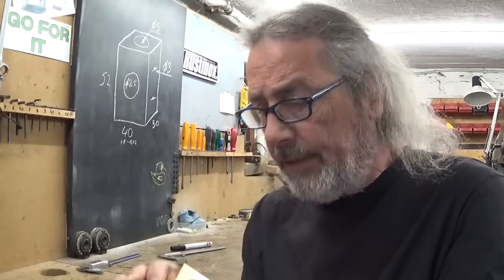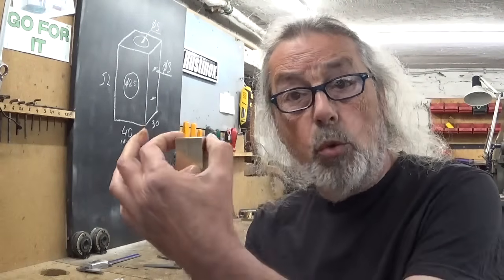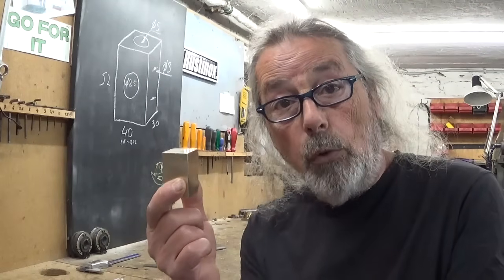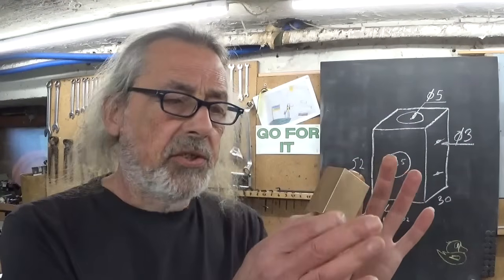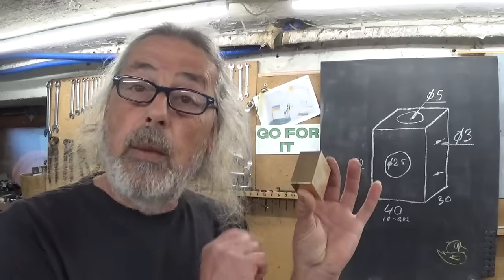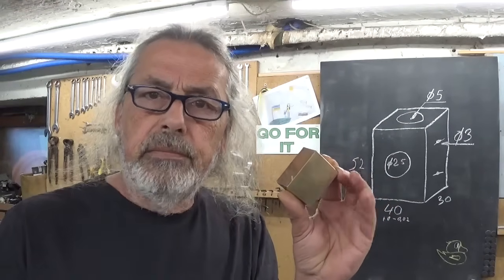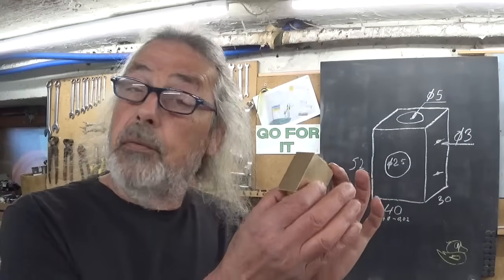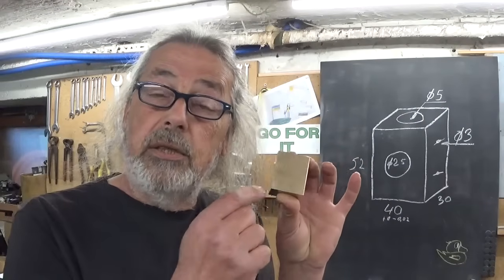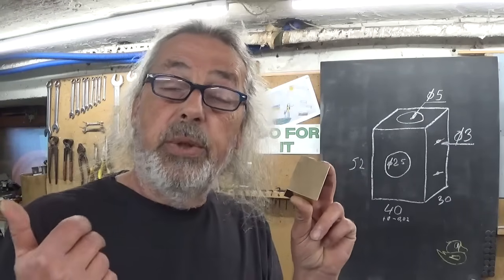Now, I'm really glad I managed to save the thickness. These 2 sides were not parallel, and now they are, well, almost. It's just that the thickness is more or less 0.2 of a millimeter less than the original one, so a tiny bit undersized. But I'm pretty sure it will not affect its function, so that will be okay. Right, all that's left to do now is to make a bunch of holes in here. But that will be for next week's video.